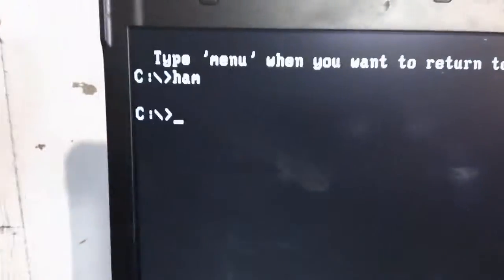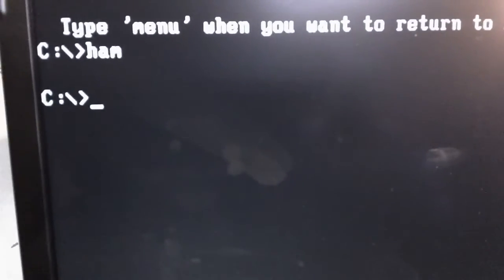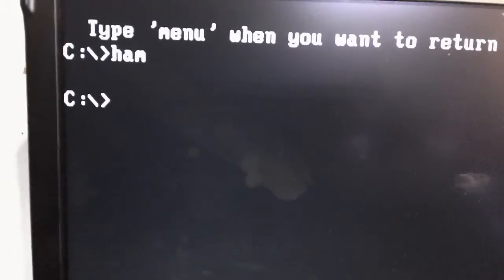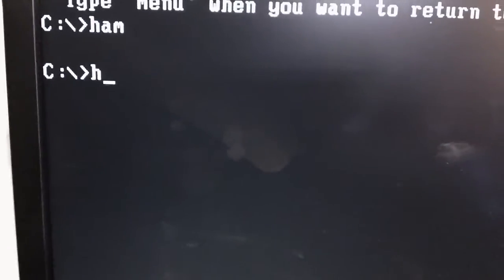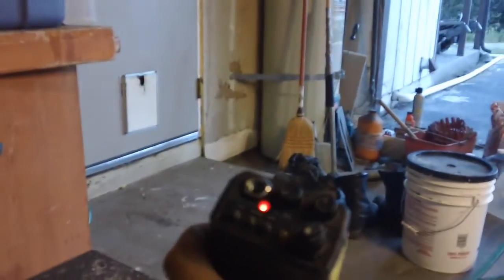Here I have the DOS operating system with the 'Ham and Eggs' program, free from a Yahoo Groups download. You unload and expand it, and there are two files — 'ham' and 'eggs'. The 'ham' file converts this radio to ham frequencies. All you do at the DOS prompt is type 'ham' and that's it — as fast as that. Let me do that again and show you what the radio does. I'll disconnect so I don't blow up my PC. Booyah — got it.